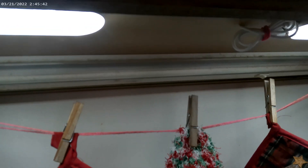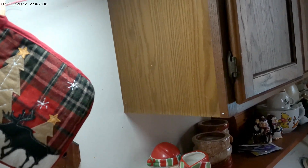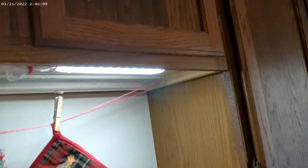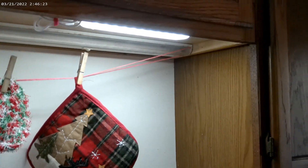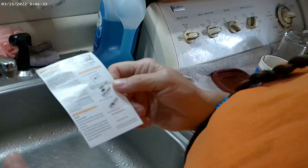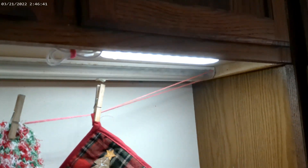Even Dan and I are able to install these lights. They would be really nice — even though they're called under cabinet lighting, I thought they'd be great for a closet, a shed, or anywhere you don't have regular lighting. If you were going to use them in a shed, you have to be in an area where the temperature doesn't go below 14 degrees. Also, you can't put them on a rough surface like brick or stucco. It has to be a smooth surface like plaster or wood.